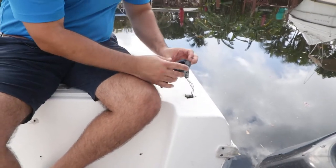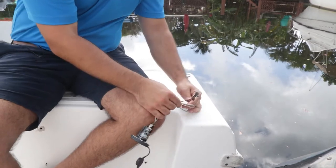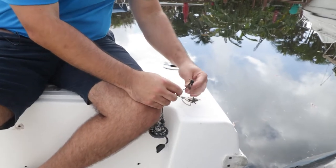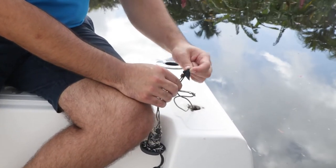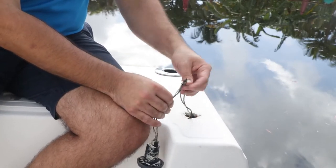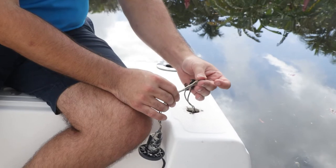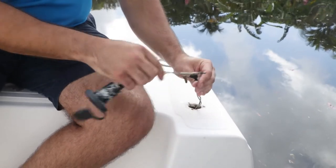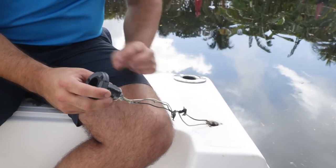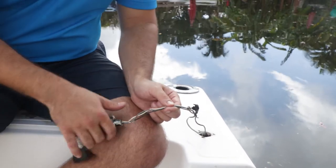Immediately upon opening this connection, it's probably hard to see, but there's a lot of corrosion in here. As I pulled further, someone did not do their due diligence in wiring this. You can see there is a lot of corrosion on this connection, and it isn't even really fully covered — just a little bit of electrical tape. When you start to see green and black, there's a high likelihood that it's not conducting any electricity through that connection at all, which can cause your electrical devices not to work. The entire thing needs to be replaced at this point.